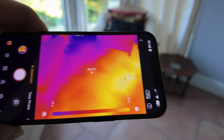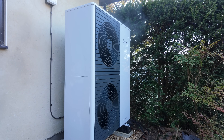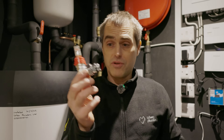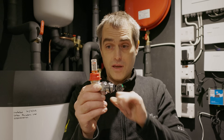I'm quite happy that a very simple solution — using just a flow-limiting radiator valve — works on underfloor heating. The biggest benefit is being able to see and adjust the flow rate. The system operates absolutely fine and we got to test it at design conditions, meaning very cold weather below zero. The setup is as simple as it gets: no buffers, no additional pumps — just one circulator inside the heat pump running through large primaries to the house. The heating system operates as one big zone, running underfloor heating and radiators at the same temperature, with those little flow setters for any adjustments needed.